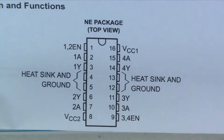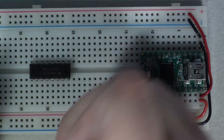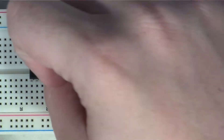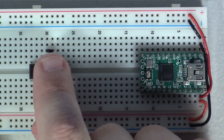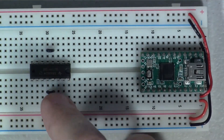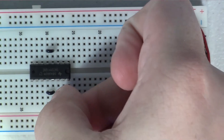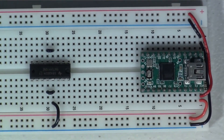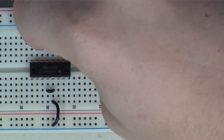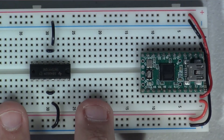To start, I have a couple of tiny jumper wires and I'm going to use these to bridge the two ground connections on either side of the chip. Now that those little bridges are in place, I'll pop in the jumpers that connect those to the ground rail on our breadboard. Now we have both sides connected to ground.